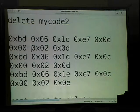Yes? Did you look for fixed lock codes? Like essentially a back door where it's been put in there at 1, 2, 3, 4, 5. Actually, that is one of the things I did. When I got it all working, I didn't realize there was this unregister and register part of it. So the module, when you connect it to the lock, you can send it a command saying, hey, I'm your new module, let's work together. And when it does that, it's supposed to delete all of the lock codes that it knows. And it actually does that. When you unregister, it does that. And when you register, the module will send over any lock codes it had already known in advance.